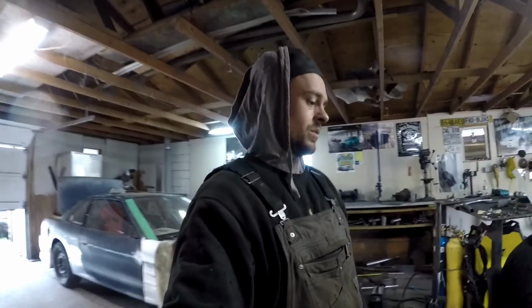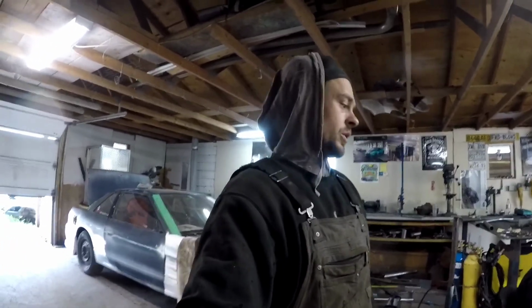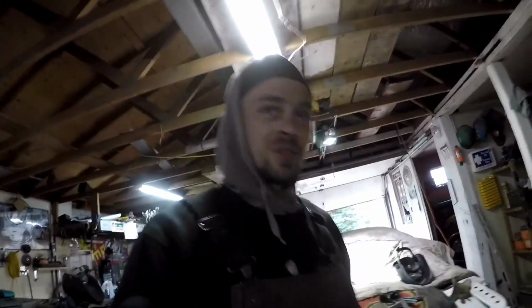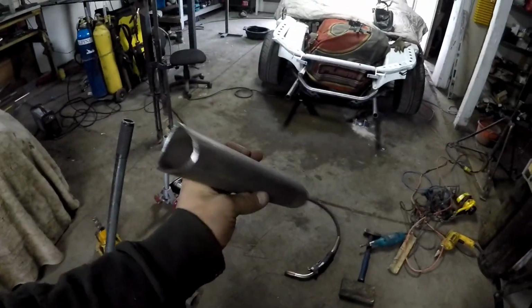So this time around we're gonna make something a bit more sturdy, and hopefully we can keep this chassis alive for more years to come. So just cope this guy up here. Everything I do is for the most part by hand. I don't have a coping machine. I was taught by an old pipeliner how to cope big inch pipe, and just kind of applied that to a small DOM tube. So this is our new upright.